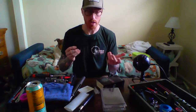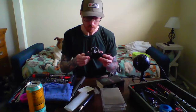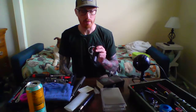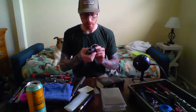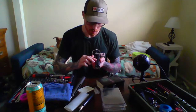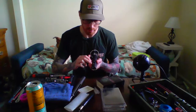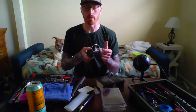This is actually a two-piece receiver, which is fine — the tail end is held in by the rear scope rail screw. You do have to drill a hole for the air fitting in the receiver. Looking at the bottom of your receiver, you can drill the hole anywhere between the front trigger box screw hole and the body bolt. I like to drill it right behind the body screw hole because the pull will be the shortest.